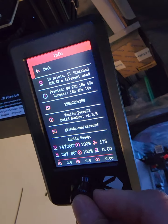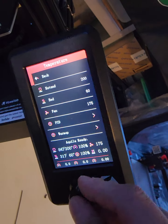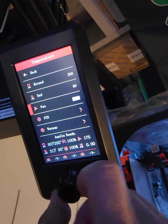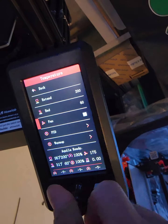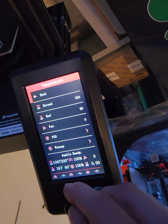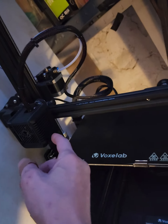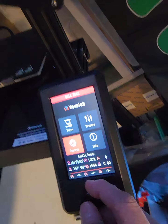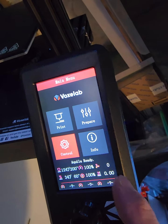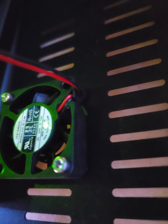Now watch when I go into temperature and turn the fan down to zero. Fan zero. So now, that is the parts cooling fan — that is supposed to be this fan. Parts cooling fan: zero. Motherboard fan: not spinning.